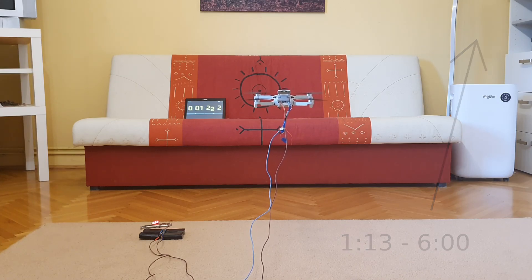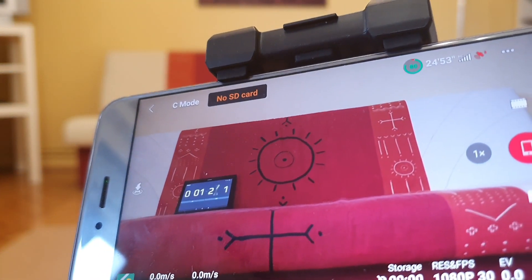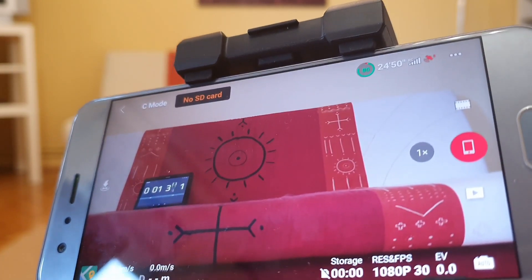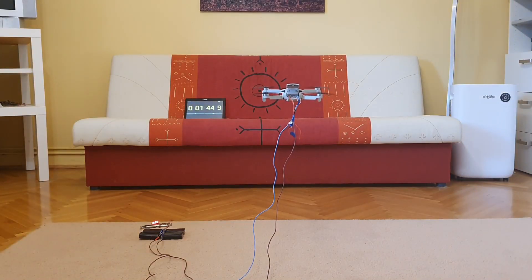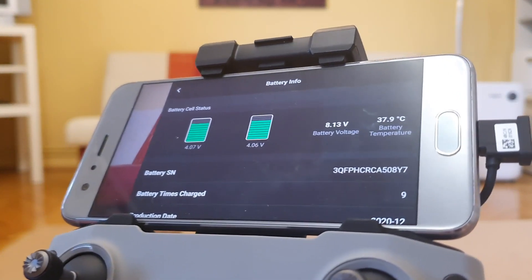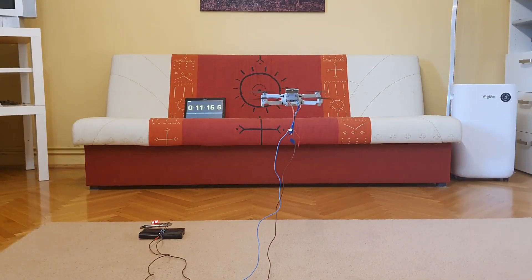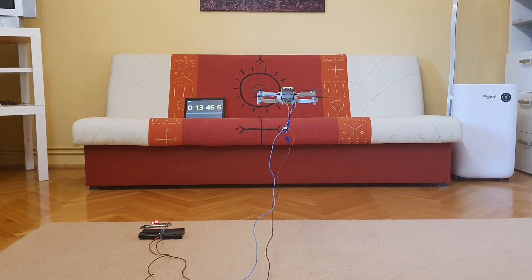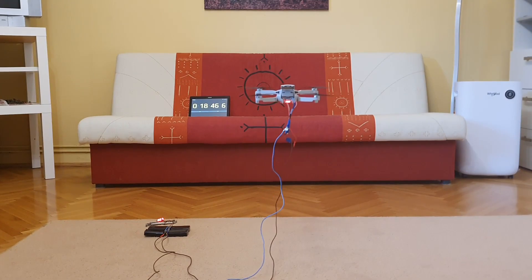I know that this is cheating, of course — this is not the idea here. Those batteries are only charged up to 80%. But what I want to see is what's happening if the added weight is not there as a problem. Would the battery let the drone fly longer, or would it stop at the rated capacity? Because I know that the rated capacity of the battery cells in the factory battery pack is coded into the firmware of the PCB in the battery pack. So the battery, and thus the drone, knows how much capacity the battery should have.